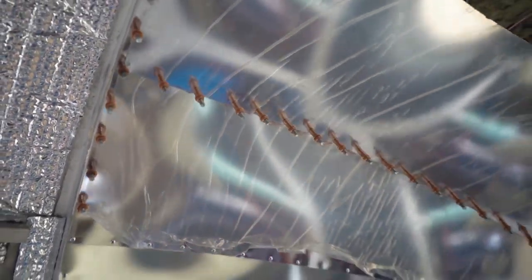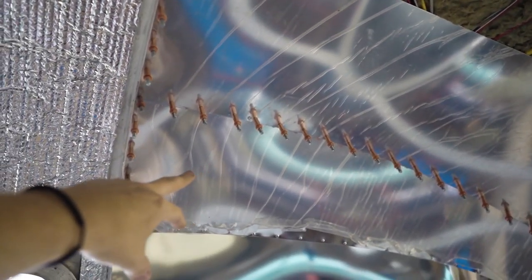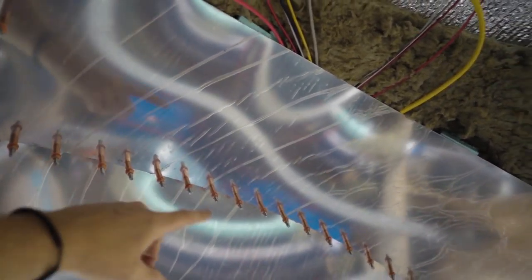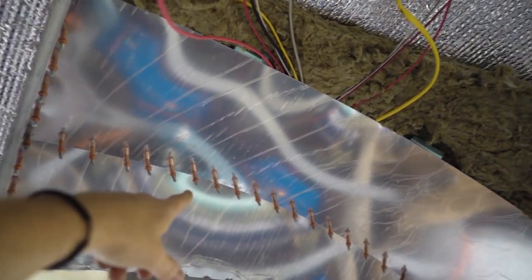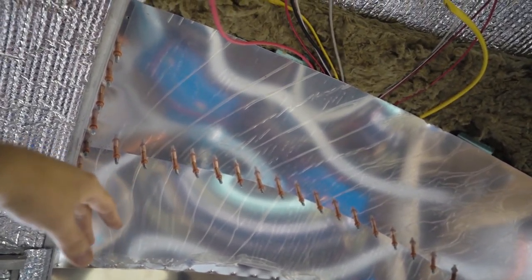All right, so this is the example of what I was talking about as I go. Basically, I've got all my holes drilled for the next panel into the underlying panel. Now that I've got it into place and I like it, my measurements match up with my right side down here to feather it in. Now I get to take all this panel back off completely and clean all the metal shavings out of the back there so they're not scratching or seeping through, or there's a bunch of metal shavings everywhere.